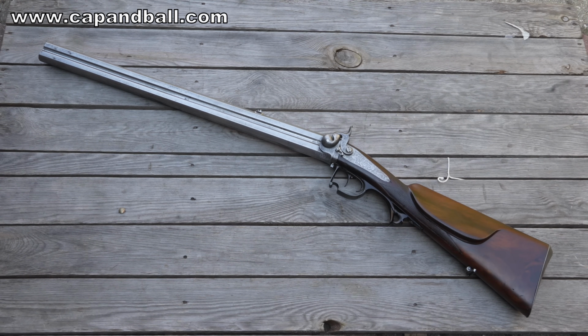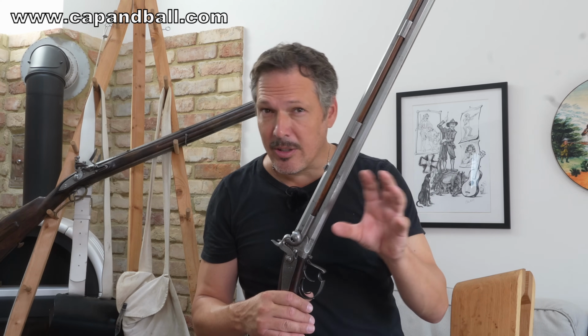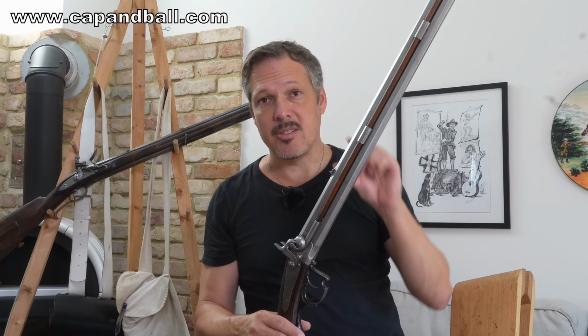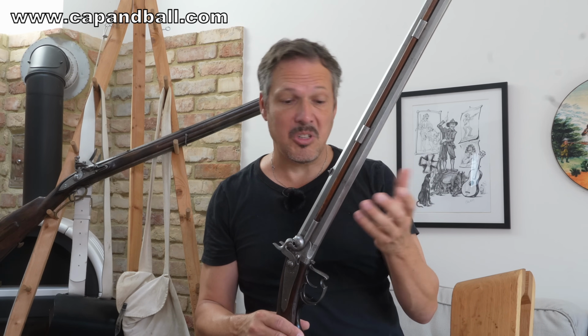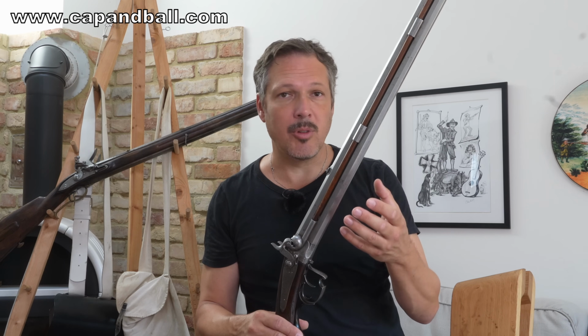So we have an upper bore with spiral rifling and the bottom bore with straight rifling. Let's talk about the real purpose of that straight rifling. There are basically two ideas behind it. The first one is related to the usability of the gun, the loadability of the gun. They say that as the grooves are increasing the inner surface of the bore, the residue of the black powder will settle, will spread on a larger surface, meaning that its depth will be less, which means that you can shoot more with a straight rifled bore than with the same caliber smooth bore.